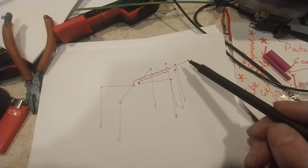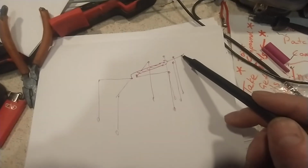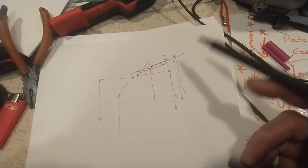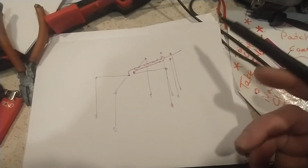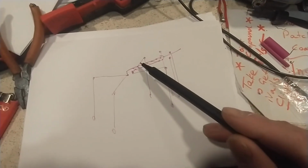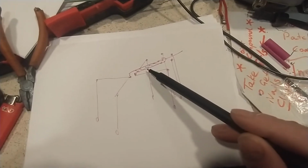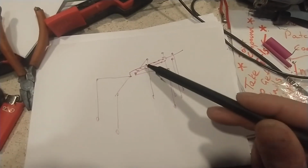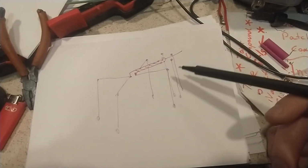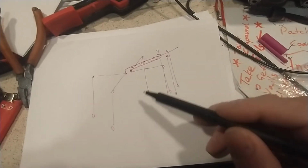If you're using a different coax, that's fine. Make sure you measure it to be a half wave, factoring in its velocity factor. And then that's where we connect the antenna feed point. For tuning, the spacing between the parallel conductors will be a fine tune. It's basically a capacitive tune. So that's the fundamental principle. Everything else remains the same.